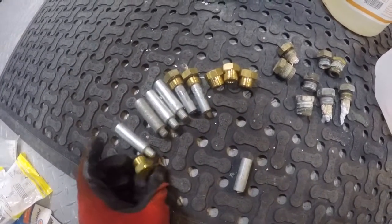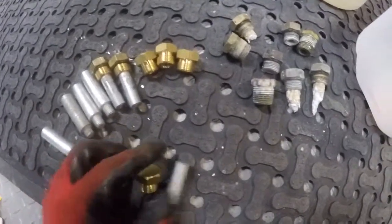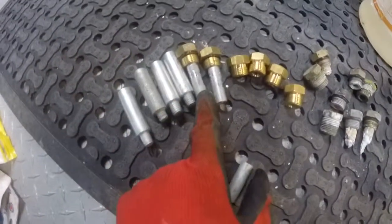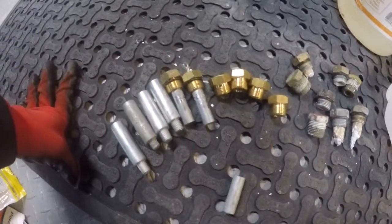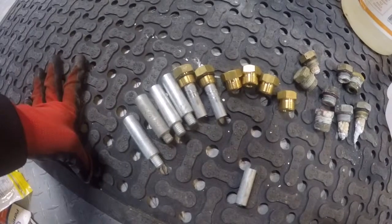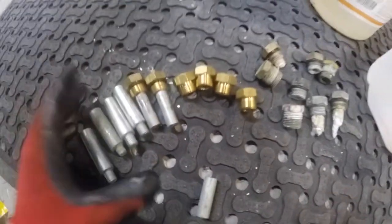Basically, those would hook together like that and thread in. What I have here is an E2, and this one is a little bit smaller — this is an E20HZ. My particular engines use 10 zincs per engine. The E20HZs seal with an O-ring, and the E2s I use thread sealant, as you can see on this used one.